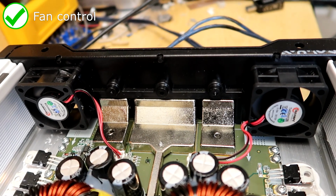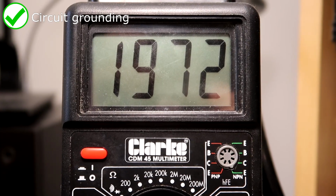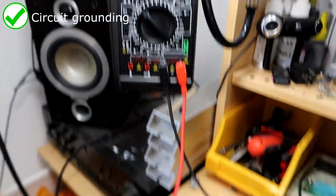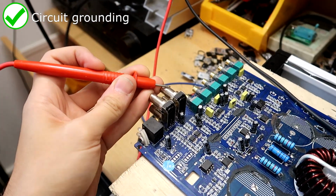The RCA ring ground is a completely separate floating ground to the amplifier's main ground. This is super important when you're running multiple amps or different amplifiers and different brands together for bass and front speakers, as running amps together with one having floating ground and one having a common RCA ground is one of the biggest causes of that awful noise and alternator whine coming through your speakers. Older Brazilian and other cheaper Chinese amplifiers are especially bad for running the signal level ground on the RCA common with the main ground, so this is great to see here on this SMART 5.